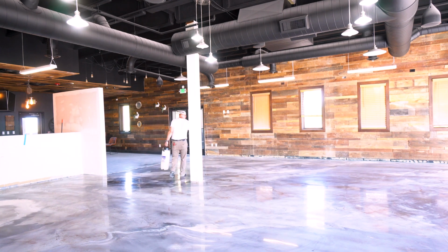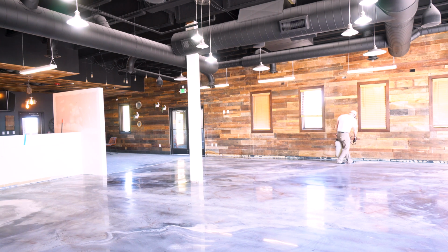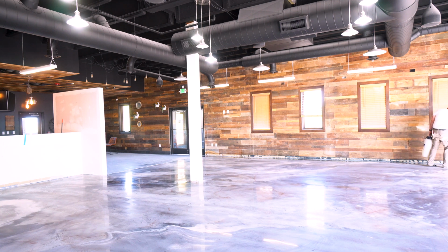This is the top coat, polyurethane top coat. I used a pump sprayer on this, and I'm basically just doing it in little 5-circle areas, 5 circles at a time. This is sped up 3 times. This probably took 8 hours to apply to the floor. I actually did this by myself. You're flooding the area, but not over flooding it. And it basically applies down without any roller marks or brush marks or anything because you're using a sprayer. It's a pretty unique product, and it's obviously one of the best.